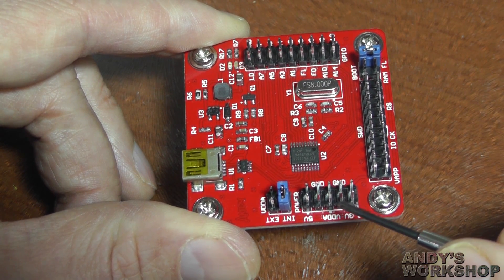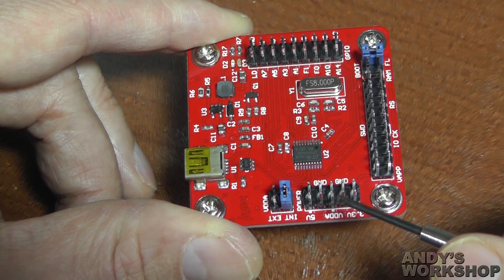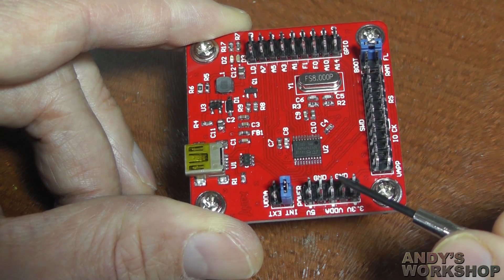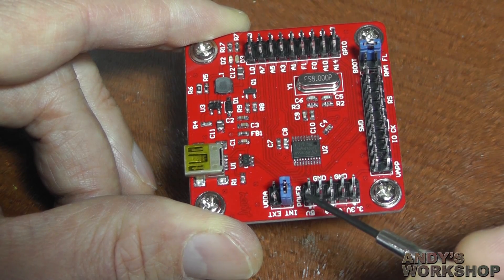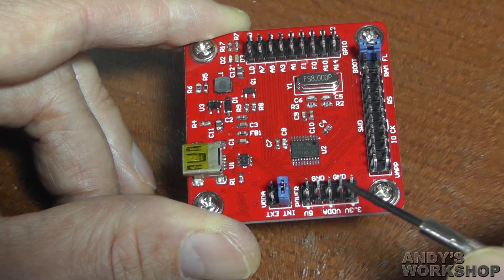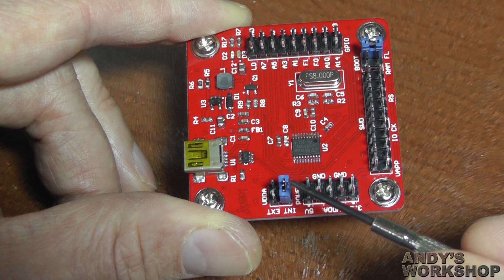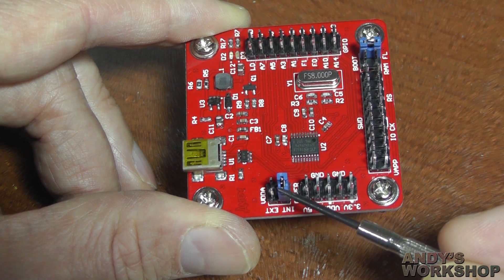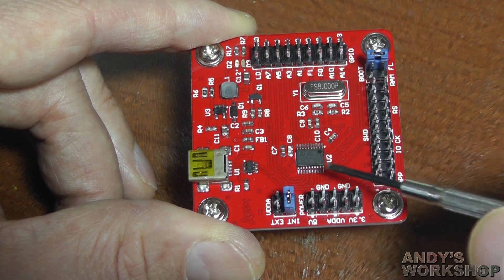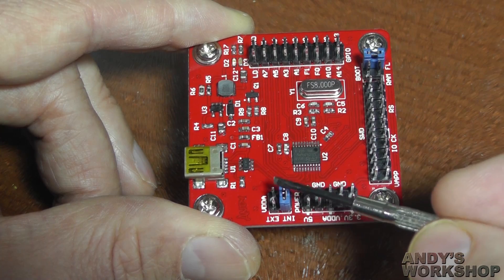Around the edge we've got power in and out pins. Another thing that bugged me about some dev boards is you just don't get enough ground pins. You can't have too many — if you've got any empty space just put ground pins there. I've got a block of four nicely in the middle and another one over on the GPIO header. We've got 5V out straight from the USB line and 3.3V out from the regulator. There's also a jumper for selecting where VDDA — the reference voltage for the ADC on board — comes from. With the jumper in place it comes from the switching regulator, but if you want to supply it externally you can remove the jumper and supply VDDA to one of the pins.